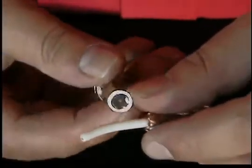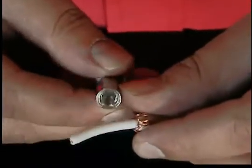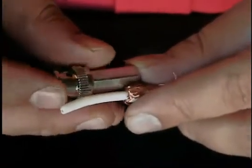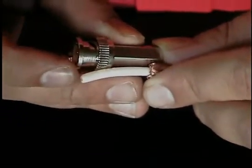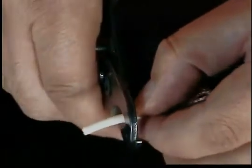Now typically the inside of the connector, you only have about a quarter inch of thread in there. So I would ballpark it right there — you have your center conductor at the length of the connector. Let's go ahead and maybe cut it halfway here, and strip a little piece.